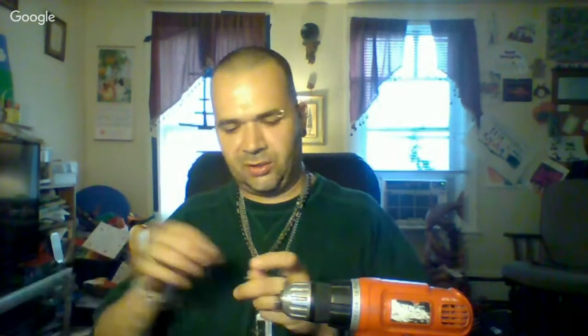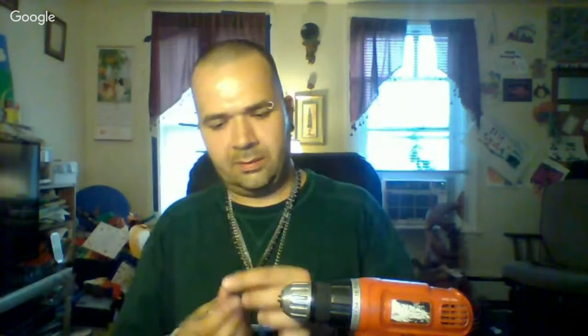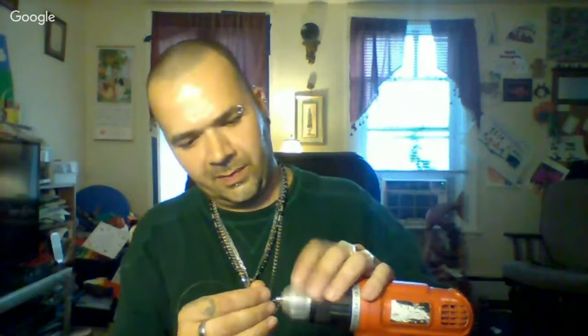So let's go ahead and unravel this a little bit here. It's kind of tangled up. We're gonna put it in the chuck. We're gonna give it a little spin, straighten it out. There we go. A lot of you know that. That's how you straighten out wire. You put it in your chuck, you pull the wire, you grab the other end, you hold it with some needle nose pliers and give it a little spin. And what that'll do is it will straighten out your wire, just like that.